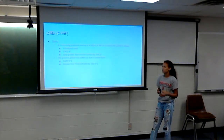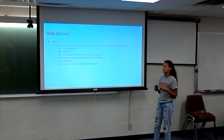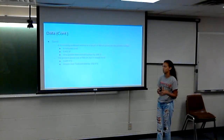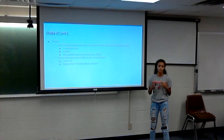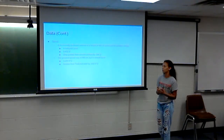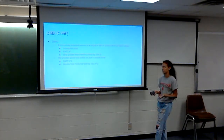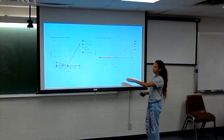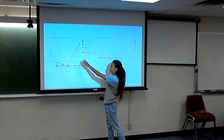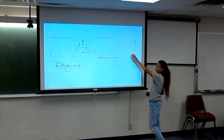For sand, the same geometric setting held: a horizontally polarized antenna at a height of 160 centimeters. Our highest voltage was found in textured sand and our greatest power was found in smooth sand, but the differences were very minuscule. Textured sand was only 0.006 volts greater than smooth sand in voltage, and power was only 0.002 volts squared greater in smooth than textured sand. As you can see in the graphs, the horizontally polarized textured and smooth sand lines are barely distinguishable from each other.